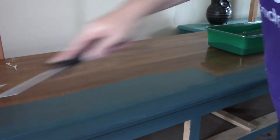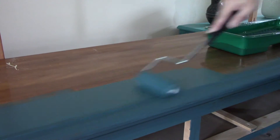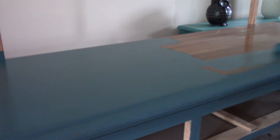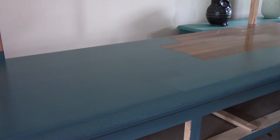Next I used a smooth roller to go over all of the smooth portions of the set — that would include all of the tops, the sides, and the drawer fronts. I made sure to get a roller that had a very smooth nap to it. I got one of the little mini ones, about four inches long, with their own little rollers and trays to go with them. It's lovely because you don't end up wasting a ton of paint and they're very portable. You can move it from place to place as you're working around and getting to different areas. I just did nice long, smooth strokes, trying to go across as far as I could to get a nice smooth finish.